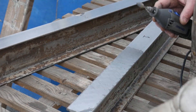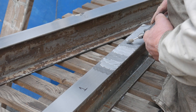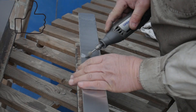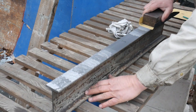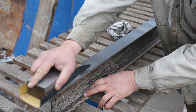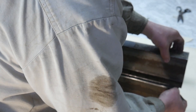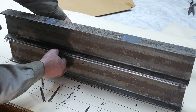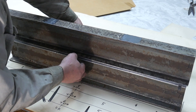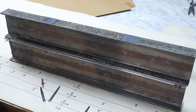This time I prefer to remove the steel with a rubber abrasive tool. This was done for several hours, but as a result the gap between the rulers became the same size — about plus or minus 5 microns. Now the probe, thinner than the support probes by 10 microns, passes through the entire gap with the same resistance. At this stage I do not perform spotting.